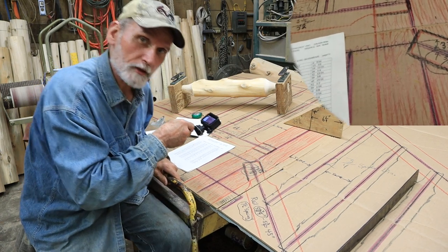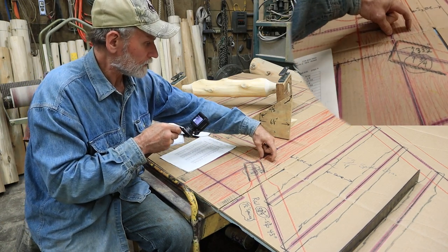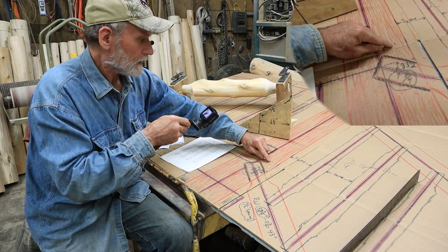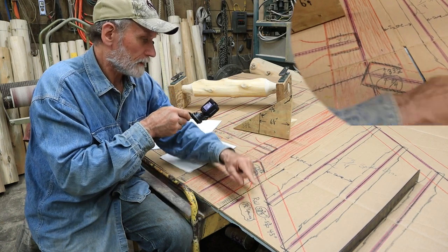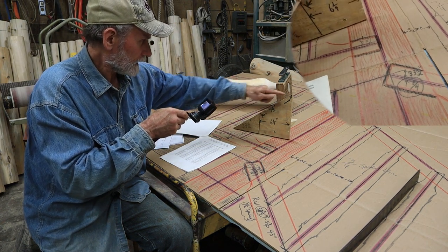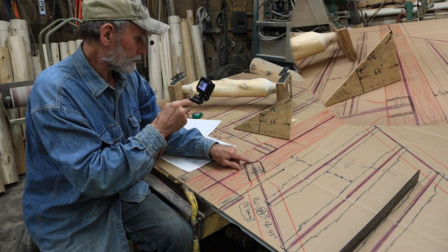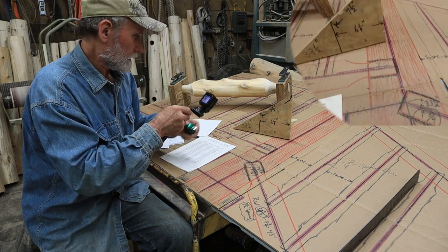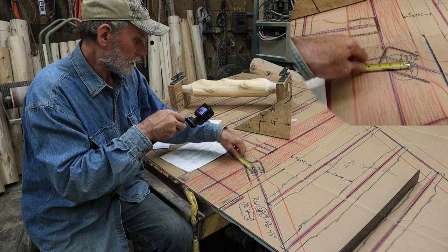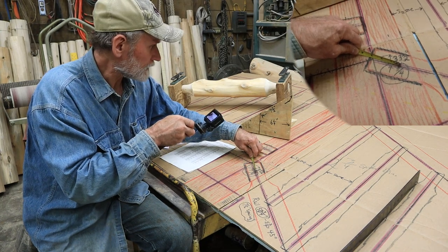Now we get to the one that's a little more complicated. That stairway. But we're going to use the same idea. We need to subtract off something that gives us a number that's in between here and the part that matches way down there of our post. And here, since this angle is like this, and things get longer because of this, it isn't 1¾ inches anymore, it's more than that. See, if we go over our approximately an inch and three quarters, then that makes this like 2 3/4, a whole inch longer.